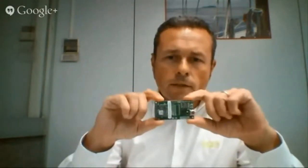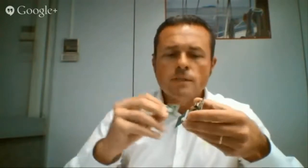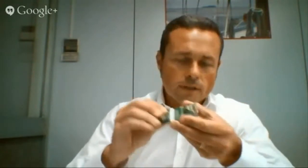Hi Josh, nice to see you. So talk to us about your dev kit that helps us save six to nine months of dev time on an RFID solution. The main thing you can find in the dev kit is this board — an adapter board with a USB connector — and the core of the product, which is this very small UHF RFID module. It's a complete reader in this small size, and it's able to read up to three to four feet away from a simple label.